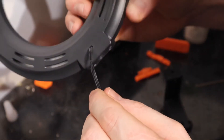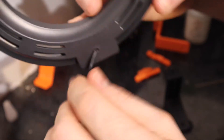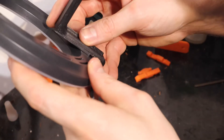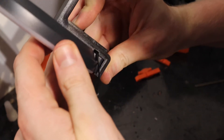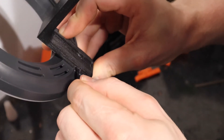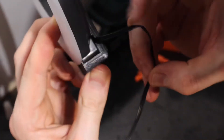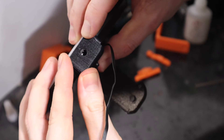While that's setting, we can look at how the ring light actually sits on the bracket. You can see the ring light here with the wire coming out the back. I needed to make sure I had a groove on the back for that to sit in - it literally just slides in there perfectly, the wire is not under any pressure whatsoever. You can see it moves up and down freely. I've also got a little raised lip that locks the ring light in place, and then underneath there's the locking bolt that screws in.